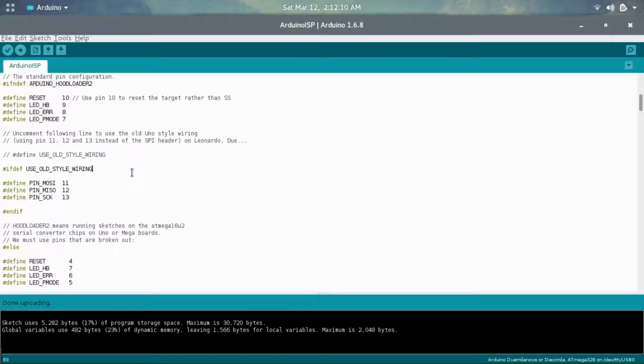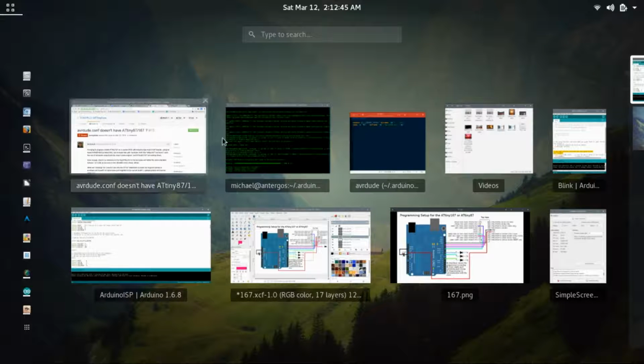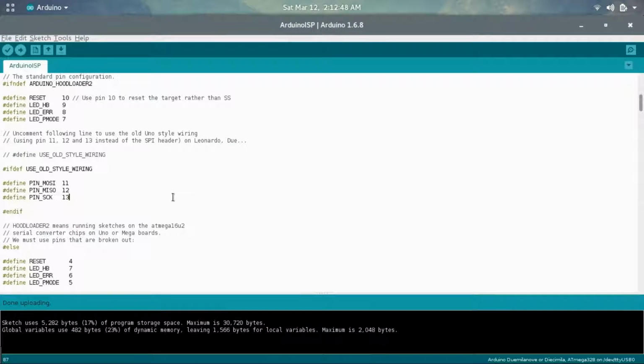1 megahertz rate, and this is not good enough. This is not what you want when programming Arduino. You're going to have a lot of issues if you keep it at that rate. For example, if you do the blink program for 1 second, it's going to be either extremely too long, for example like 5 seconds, or extremely too short, depending on your setting.